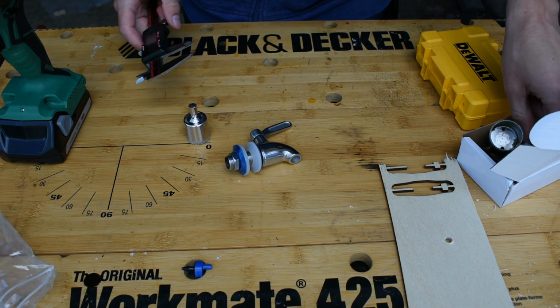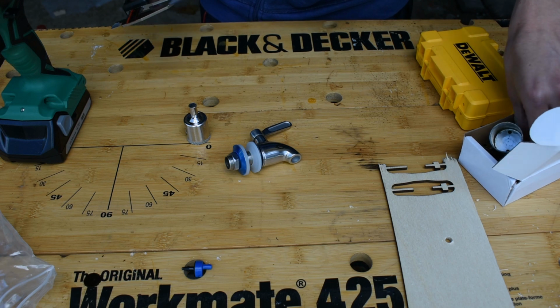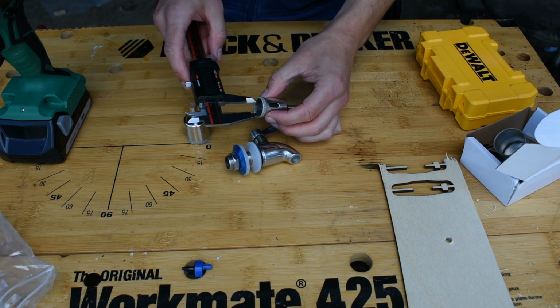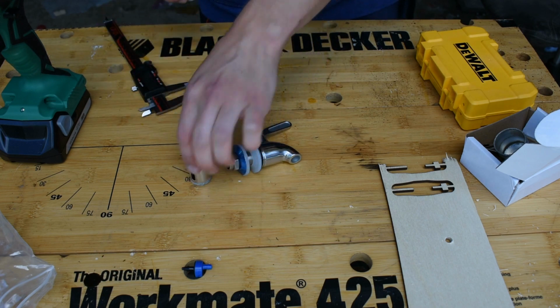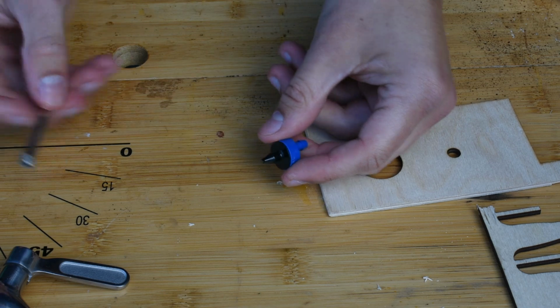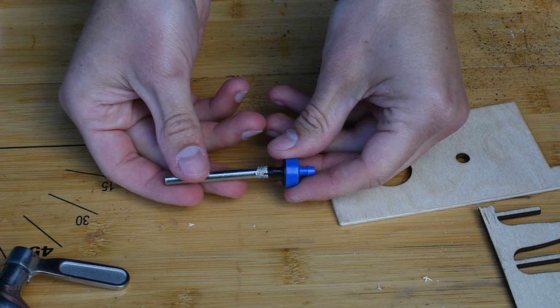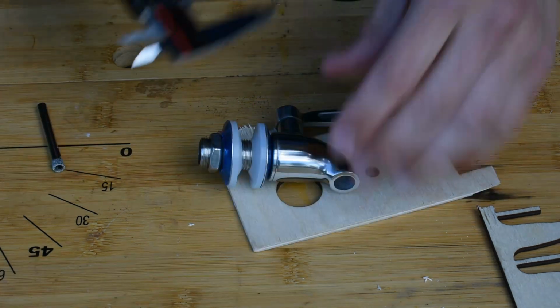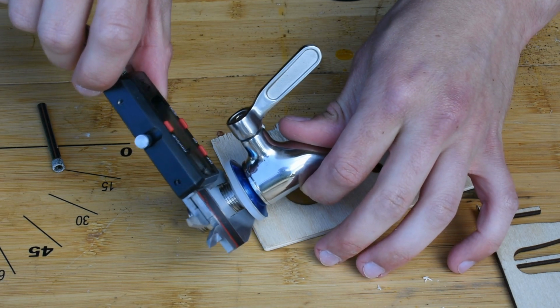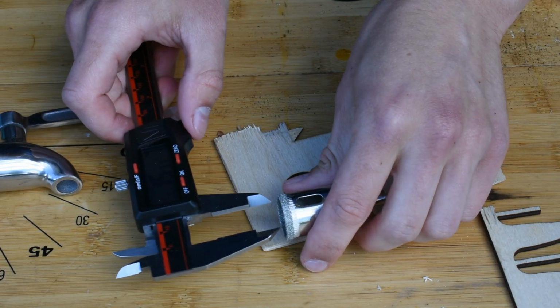The easiest method I found to cut specific size holes into glass is using diamond-coated drill bits. You can get sets of them on Amazon or eBay for probably around $12. I used 2 sized drill bits when cutting. The smallest I use for the hole that the drip emitter will go through, and the hole that goes on the bottom of the bottle that holds the coffee grounds. The larger I use for the optional spigot that you can put on the bottom of the glass jar.